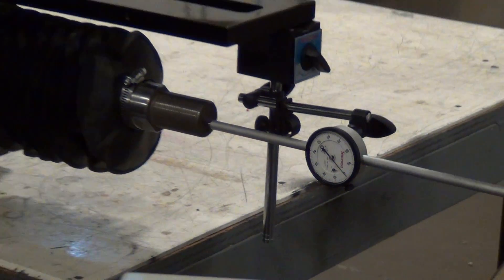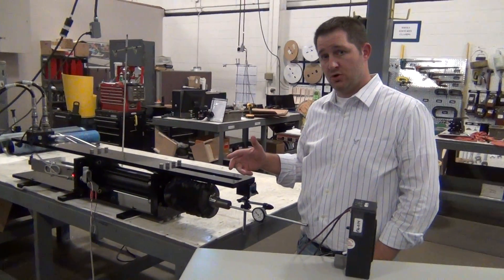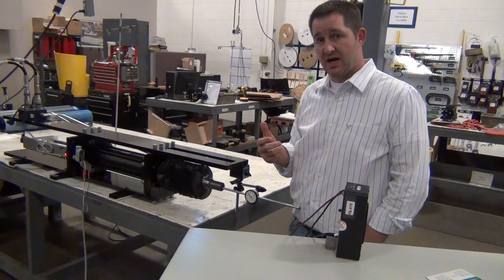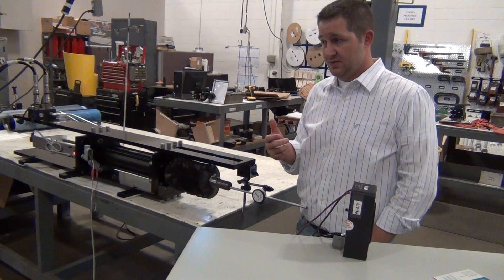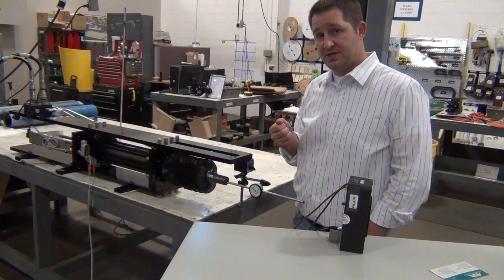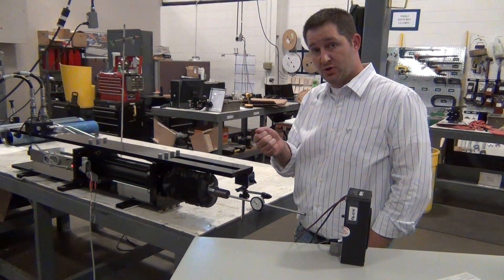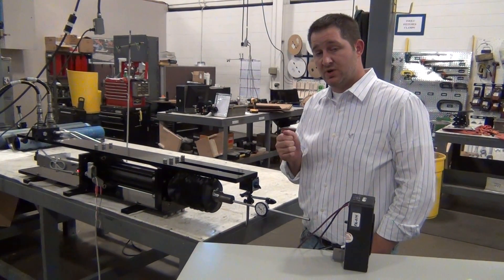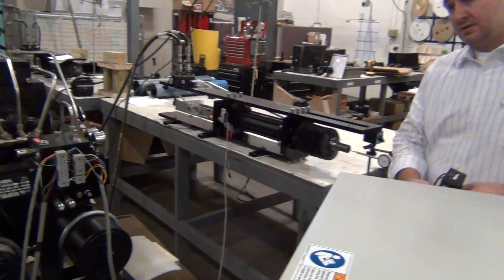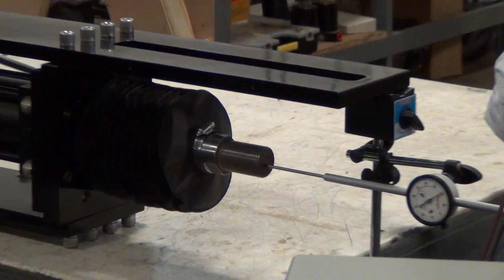What drives this hydraulic cylinder is not a conventional hydraulic system with continuously running motors, pumps, and servo or proportional valves. This is a motor-activated system. When the 4 to 20 milliamp input signal changes, a motor turns on. We use servo motors with very high frequency response, so when I change my signal, a motor activates. When I reach position, the motor stops and the system is not operating.